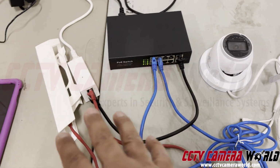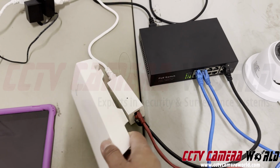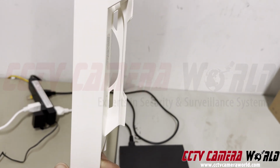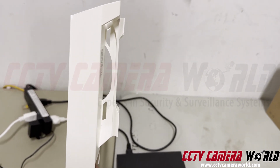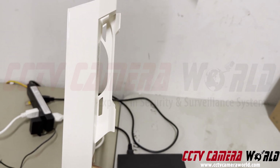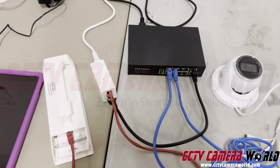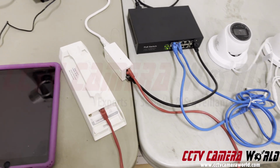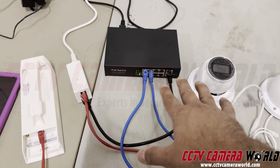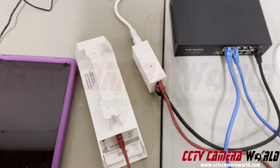So now let me just show you about the radio itself, the access point. The access points themselves are outdoor rated. You can mount them using some wiring harnesses to a mast, preferably PVC, not metal. You could use wood too, but please try to stay away from metal. If you do, keep in mind that if you have lightning nearby, it's going to impact the access points, and it could actually seep back into your network, into the cameras, and even destroy all of them or some of those components. It's just something, unfortunately, that we have to deal with in nature.